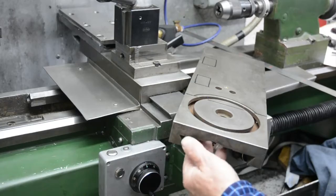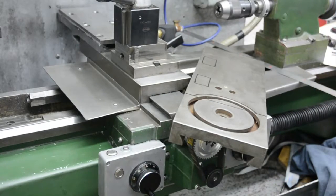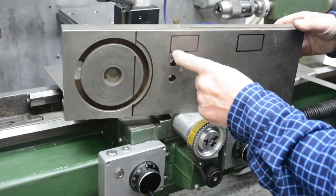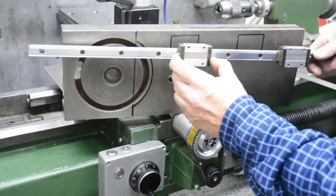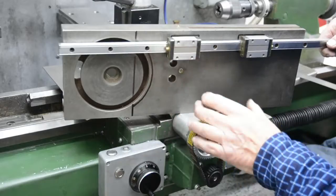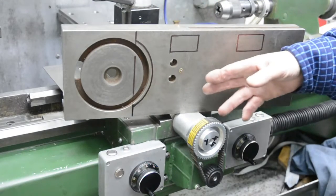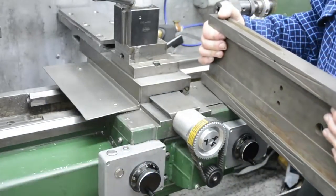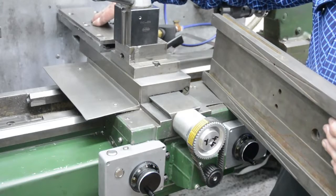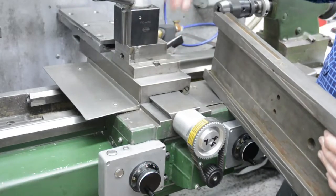The height of this is too much for when I want to fit the bearing blocks underneath there. But what I can do on the other side is mill out four pockets to take these. So imagine this is coming from the other side — these will each fit in these pockets, and another two on this side. The pockets will be dimensioned such that this surface is at the same height as this surface. Because then the piece that I've got back here to bolt the grinder onto will be set at the same centre height, and so will the tool post thing. But with these quick change tool posts you've got a lot of up and down tolerance anyway.